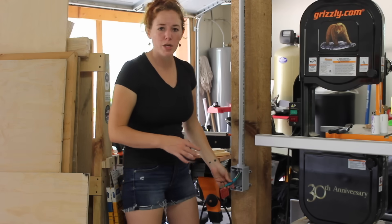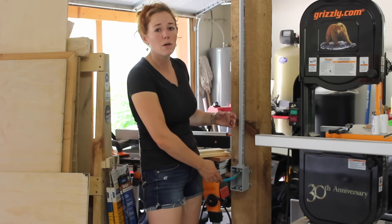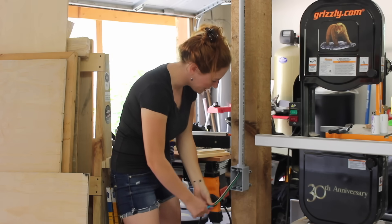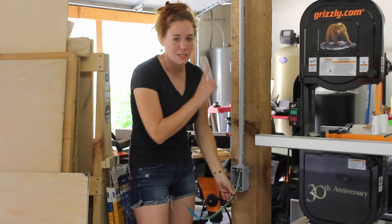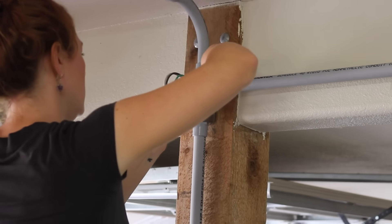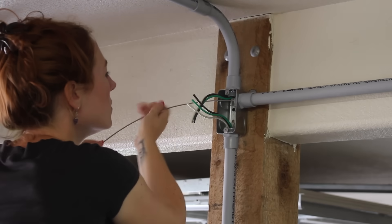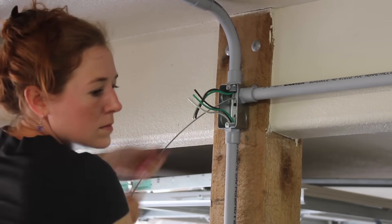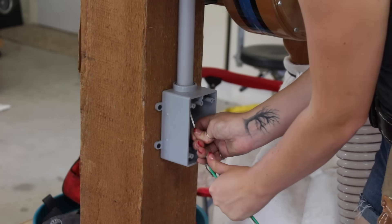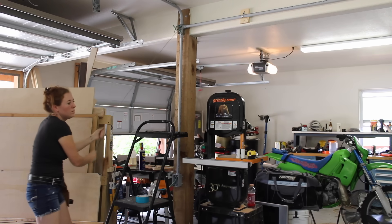If you're going to do this project, don't only leave yourself enough wire to wire in the plug at the outlet — also leave enough to make the connections in the junction box. I pulled it back out to accommodate for that slack, cut it down the center, and ran the fish tape from the junction box over to the second gang box on the right. Once the fish tape was through, I did the ground loop again and pulled the wire all the way back through to that outlet.